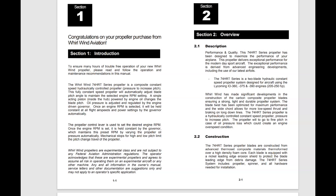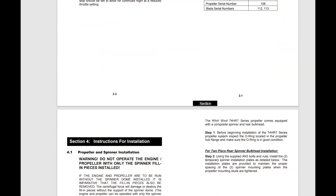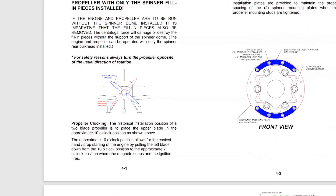We'll start with a good review of the installation manual — looking at the size of the bolts, lubricants required, torque values, orientation of the prop, and just the general instructions on how to install it.